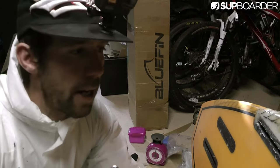So what I've got here is an electric DA. I'm going to attack what I've done with the resin and the glass. Sand it back. This is basically an orbital sander, works really well though. I'm going to get fully suited up. I've got what I call a Tyvek overall, keeps the dust out. I'm going to get gloved up, masked up, and goggles on, because this stuff ain't very nice.